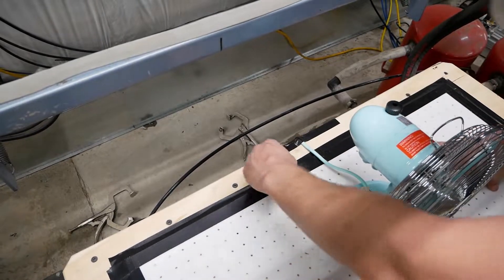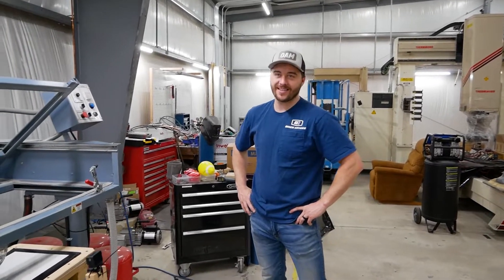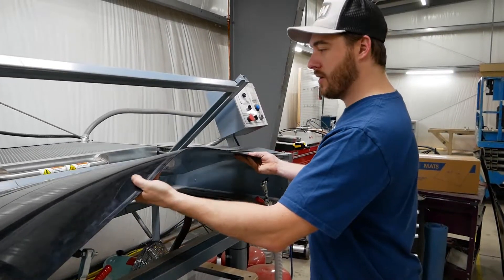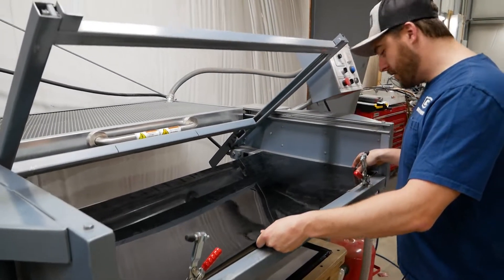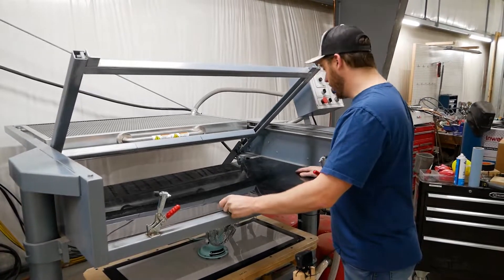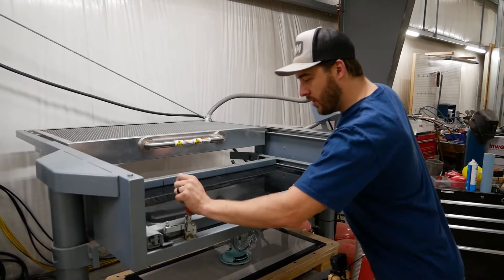If I've ever learned anything in life, it's that every time I say 'in theory,' whatever it was does not work. Let's be optimistic — here we go. We're gonna use black ABS for this one. This stuff's a little bit tougher than the acrylic, at least in terms of not being as brittle. Forming temperature is actually pretty similar. And if you're worried we're wasting plastic, these are sheets we use at OAM that have blemishes on them — so this has a bunch of scratches we can't use anyway. Perfect for the vacuum form channel.